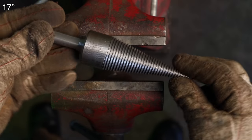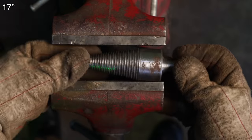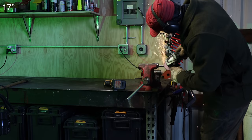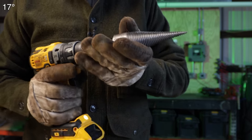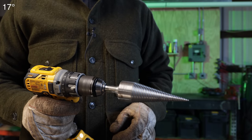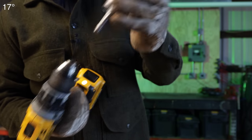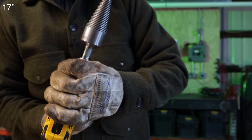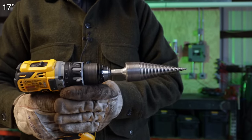We'll have to do our best, but I don't think it'll matter so much because it's not going to be turning super fast. So let's chalk it up here and see if we can take that down a little bit. It didn't take much grinding to make this fit. It's of course not perfectly balanced, but I found that if I chuck it in at slightly different spots it does seem to be better in some places. I can live with that — it's going to be slow speed.